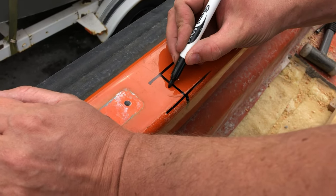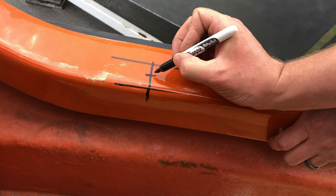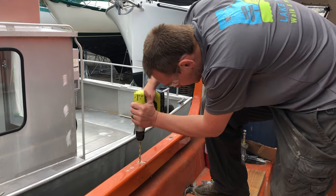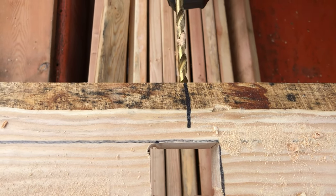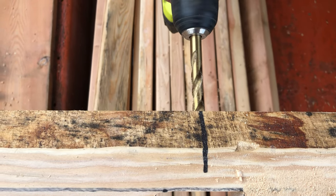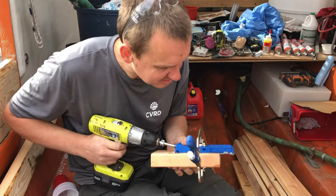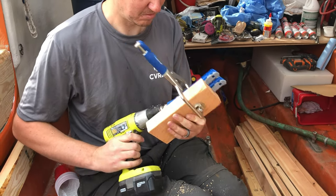Next up, we measured the fiberglass and marked out where the bolts were going to go so that we could pre-drill them and have everything line up easily. Torrin is pre-drilling into the fiberglass so that once we Sikaflex'd it and got it ready to attach, hopefully the bolts would line up as they came through the wood and then through the fiberglass. Unfortunately I don't have any film of this next part, but after the wood was ready to go, we sanded the fiberglass frame, used a layer of Sikaflex for extra strength, and then I held the wood in place while Torrin put the bolts through both pre-drilled holes and then used that bolt hole as a space to secure it all together. Once the first layer of wood was in, we needed to start building the window frames, and so they couldn't be just solid panels because we needed room for glass, meaning we had to have several different layers of wood going up the boat.